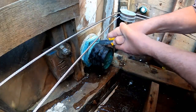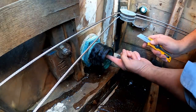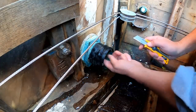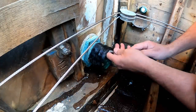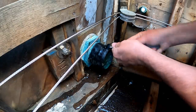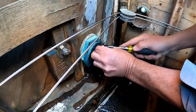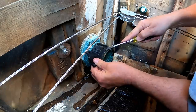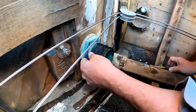And further than that, the water level is about here right now. That's why a little water just trickled out of here. And I have a bung stuck in from the outside, which is going to look after anything in way of serious water ingress. But getting all of this off of here, it starts with some sort of rubbery band of some sort. Ooh, but underneath all this is a nice bronze threaded through hull, in this case, through transom.